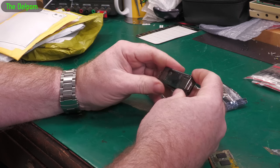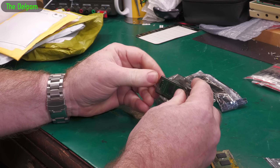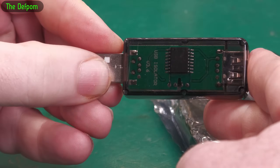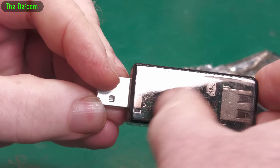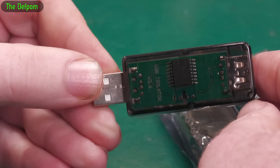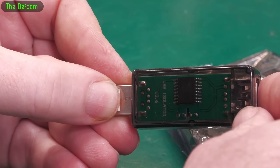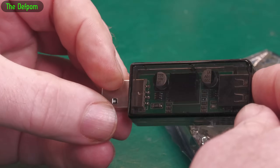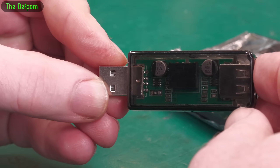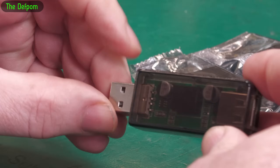I've got four of them. These are some little USB devices with built-in surge filtering - they're isolators, USB isolators. It seems like they've got switches on both sides and a filter pack. Hopefully this will create isolation. If I can use these, that might even solve it - creating isolation between devices might reduce the effects. I don't know how good these are, I've got four of them, I'm going to put these in and try them out. This obviously only works on the USB itself, but I also want to filter the Ethernet because I think that's where the surge is getting in. I did actually put some filters on those already but it didn't help.